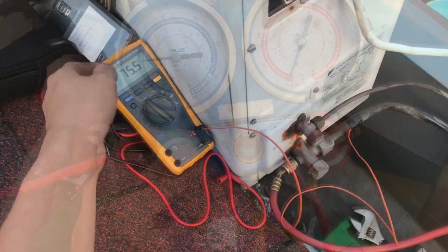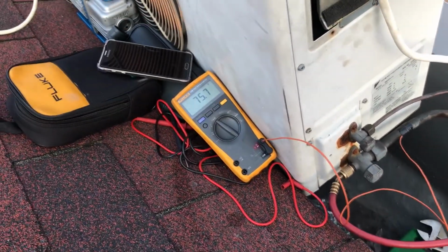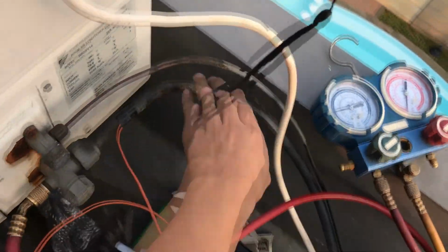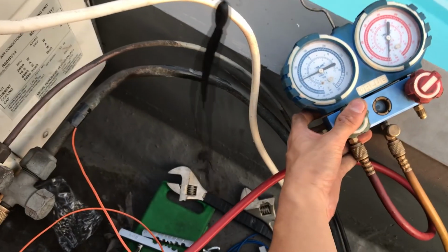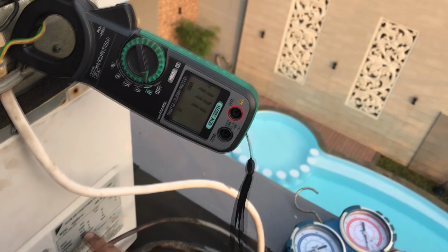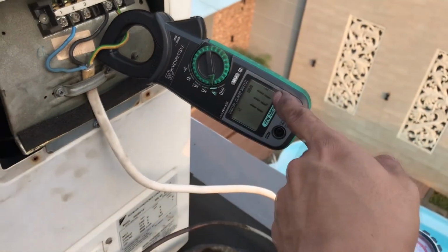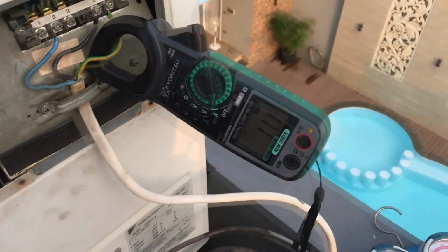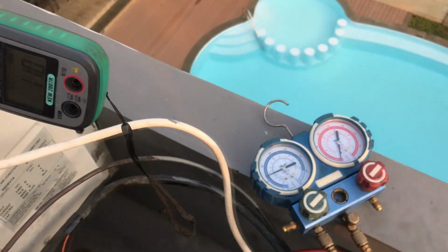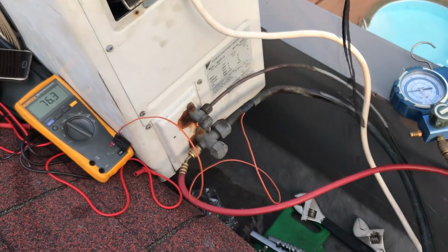Slowly. Okay, so apparently my crappy Samsung phone doesn't have enough memory to record more video. So I pretty much removed the charging part. But it's just good enough now. Even if it's a bit high, it's already 10.6 for the running, and maybe in the night time it will run 10.6. The suction line is good, the pressure is good, so we can pull this off and tidy up everything.